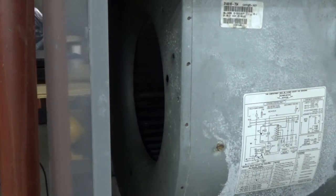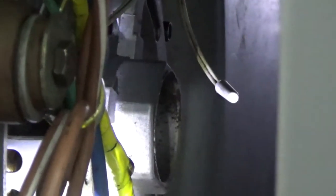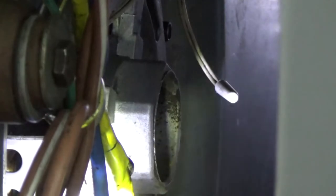I can't remember if this one has bearings or bushings — probably bushings — and I oil it from time to time. Let me zoom in. Right here you can see the oil cap. As I recall, it's not pushed down all the way, but I usually put a drop of oil in there every spring. The oil goes down and moistens up some cotton or wicking material and lubricates the bearing — I think it's a bushing, not a bearing.